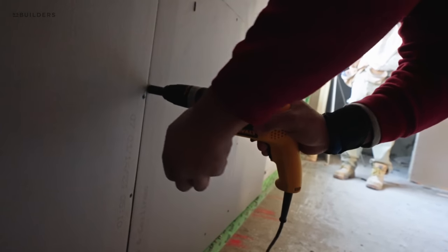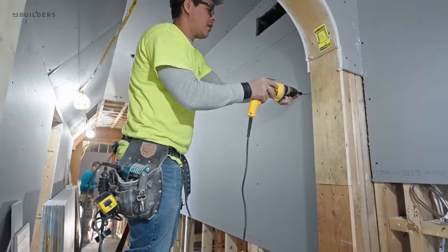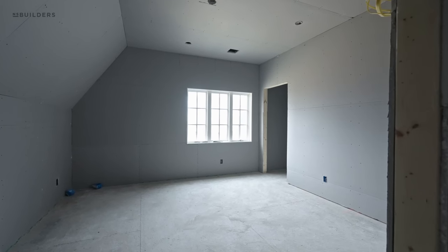Boards being hung, they will go around - it's a traditional drywall screw. Everything will get screwed to the wall. And then prior to plaster, they will actually mesh tape all of the seams and screw heads to prevent any screw popping, and then they'll get into plaster.